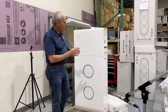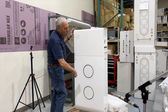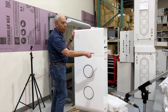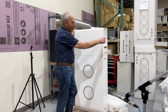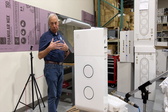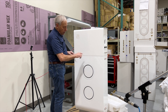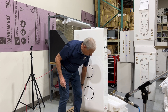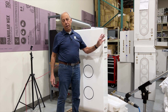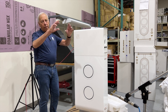A transmission line has the woofer and what we want to do is make a tunnel for the back pressure of the woofer to travel through, so that when it comes out of that port, it's in phase. We do that because sound travels about one foot per millisecond. So if we can extend the time it takes for that back wave to get out of the hole — making it run around through a maze rather than directly — if properly designed, we wind up with an in-phase port. That's what a transmission line does: the sound is transmitted through this maze.